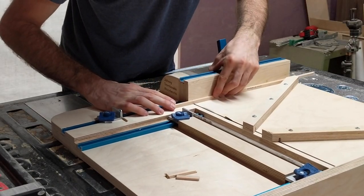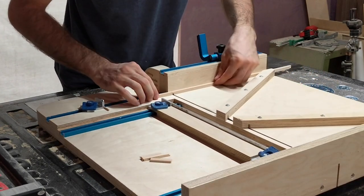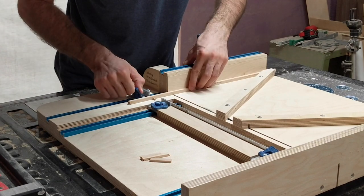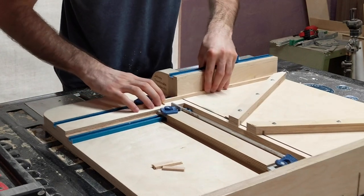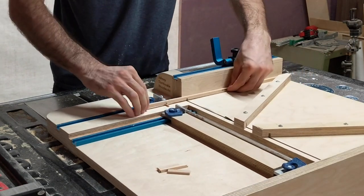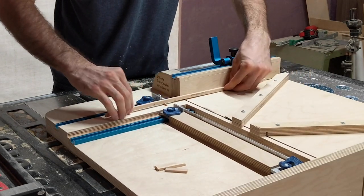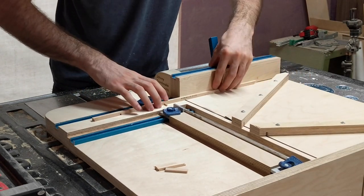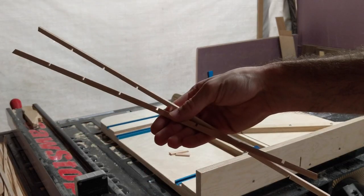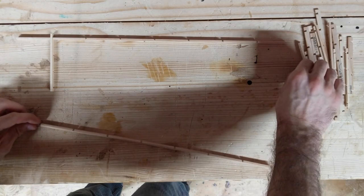At this point I was pretty eager to work on the tambour door, since this is the first time I'm trying it. I cut strips from the 2x4 to work on the Kumiko panel, and I cut half laps into those strips using my Kumiko crosscut sled. I have a video and plans linked in the description on the sled if you're interested. I cut two long pieces and a bunch of shorter ones that will link those two together and that'll make up the pattern.